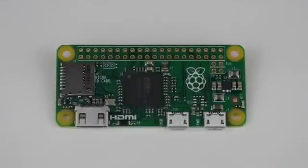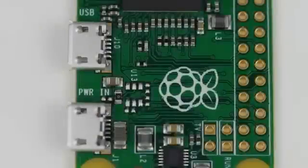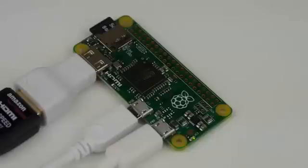If you move to the bottom of the board, you'll see some connectors that have not been seen before. In order to maximise available space, the HDMI port is now a mini HDMI port. This has no effect on the output capability of the Raspberry Pi Zero — it is still capable of full 1080p high-definition video. Two microUSB ports can be found also. One is labelled power and is the 5V power input to the Zero, best done from a mobile phone charger. Due to its insane form factor and impressive efficiency, the Raspberry Pi Zero consumes just 160mA of power when running.